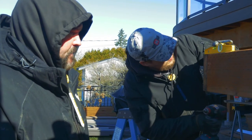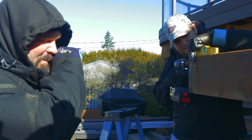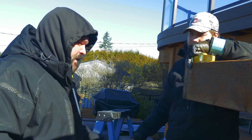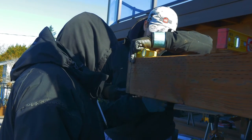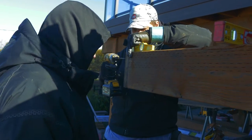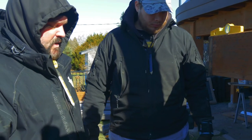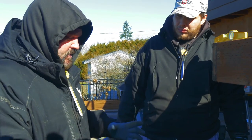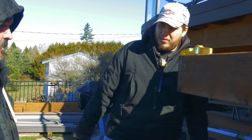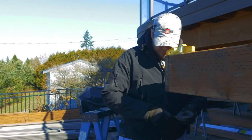From here you mark your holes and dig them — we're going for 12-inch diameter, 16 to 20 inches deep. Run a level from this corner straight down, draw a circle around it. I level down from this side, this side, and this side, so you know your two corners. The concrete needs to go further around it than that. We're going to use brackets and not sink the posts in the ground, but we still want the post centered in the concrete. Use a sonotube as a guide — 12-inch diameter.